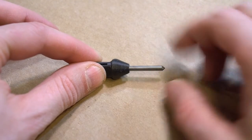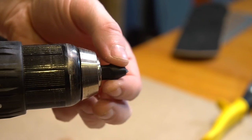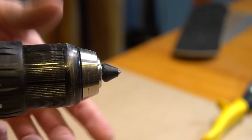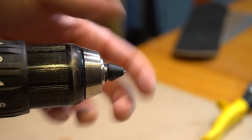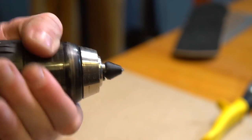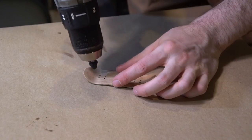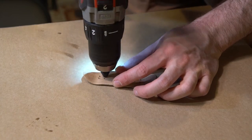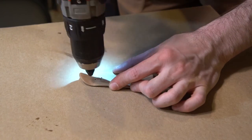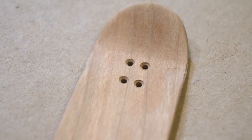The burr goes in the printed part, which gets put into the drill, and the pressure from the three-jaw chuck flexes the printed part, clamping down on the collet and locking everything in place. I can use this arrangement to chamfer my bolt holes without a whole lot of effort or thought, and I gotta say, I'm pretty thrilled with the results. That is looking super clean.